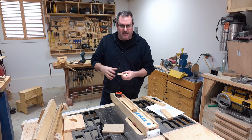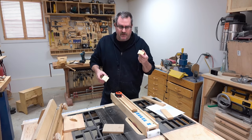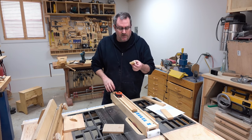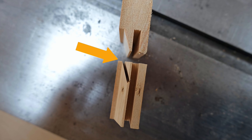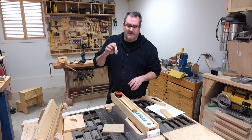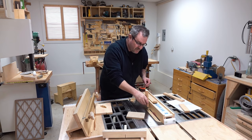I've tilted the blade to 20.5 degrees, moved the fence to the other side of the blade, and already cut a sample from the offcut of the rails. It's good to have sample pieces for test cuts. What you're looking for is the cut to start even with the shoulder up here and then extend down into the flat part. There will be some fiddling around to get this right, but when you have it you can go ahead and cut the ends on each rail. I'm doing this freehand, holding the stock up tight against the fence and flat on the table saw.